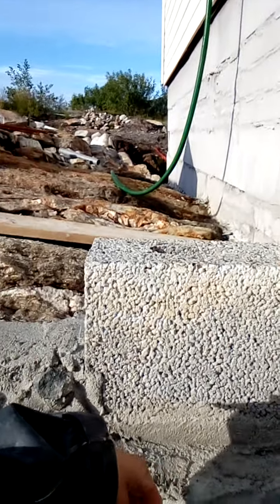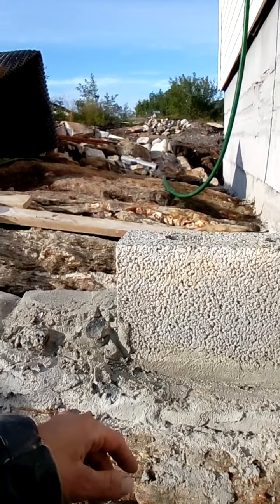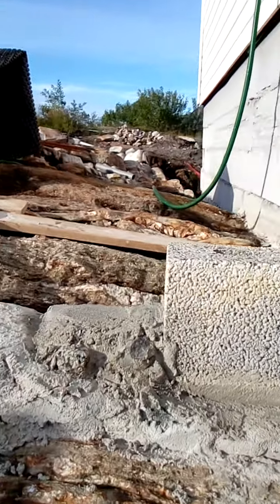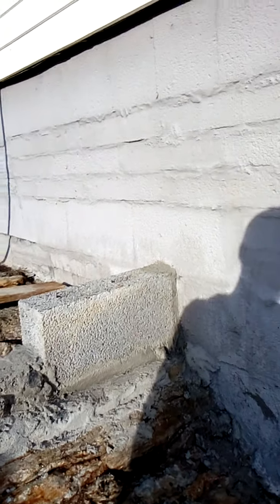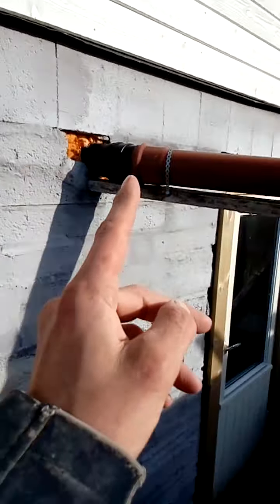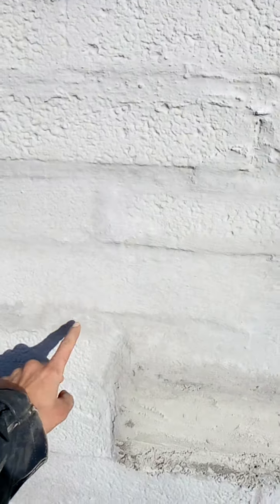This can be fixed by using rebars, because they provide a little flex and make the whole thing much stronger. If a huge bomb came in, the bricks would probably break into pieces, but everything would likely still stand — especially since there are columns in these walls in between. The same approach has been applied throughout all these walls: a rebar on every single layer, or on every layer with small ones here where we ran out of the bigger rocks from the nearby supplier and ended up using many small ones, which is why there's more texture on this part of the wall.